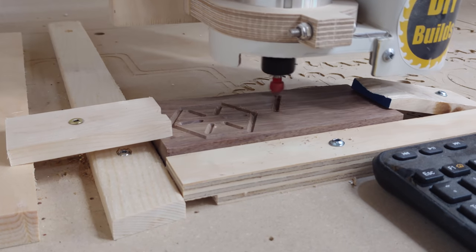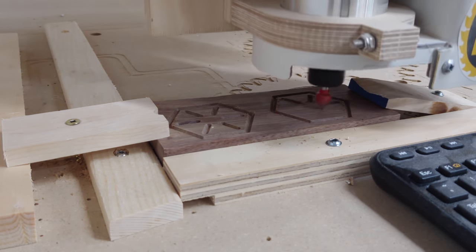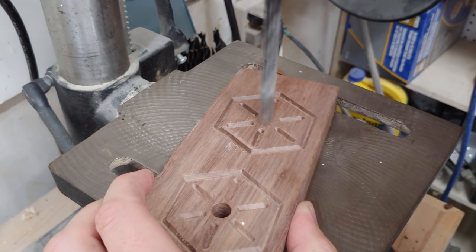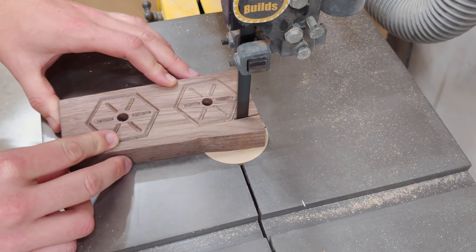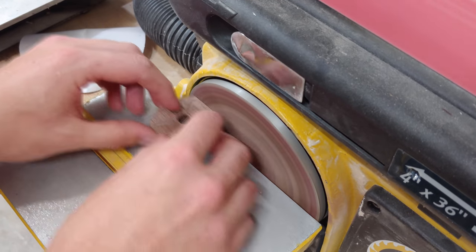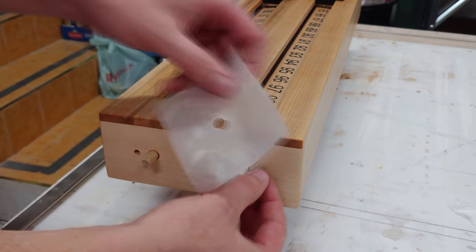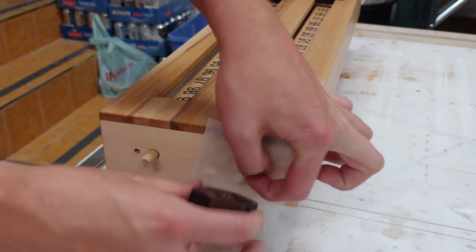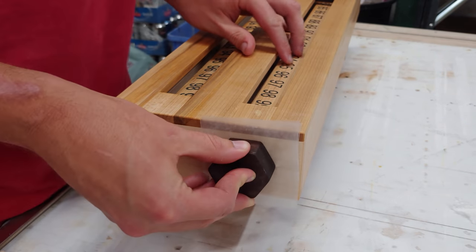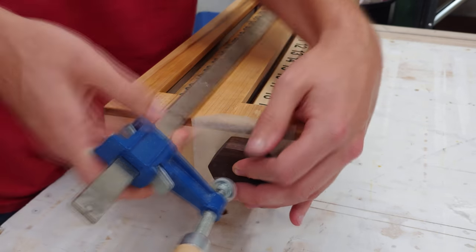Next it's time to cut out the handles, which are also made from walnut. I ran a program on my homemade CNC to cut the indents and perimeter shape using a 45-degree V-groove bit. These grooves will help register against the ball bearing and spring to allow for easy alignment of the score numbers. A three-eighths inch blind hole is then drilled onto the inside of the handles. The hexagon shape is roughed out at the bandsaw and brought to the line on the disc sander. It's very important that when I glue on the handles, I have the spring in the hole first, followed by the ball bearing. I used a couple of pieces of wax paper with a hole in the middle to stop the glue squeeze out and provide some spacing off the side of the scoreboard. These wax pieces also helped keep everything in place while I slid on the handle. Before letting dry overnight, I make sure to feel the ball register against the grooves on the inside of the handle and align that to the number faces.